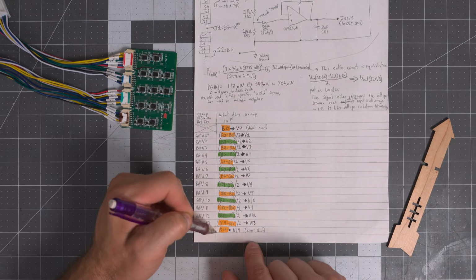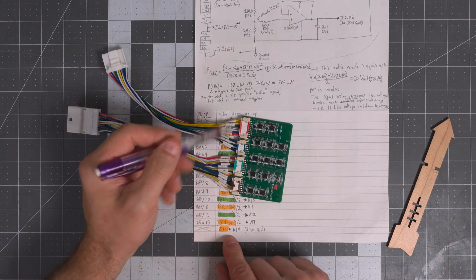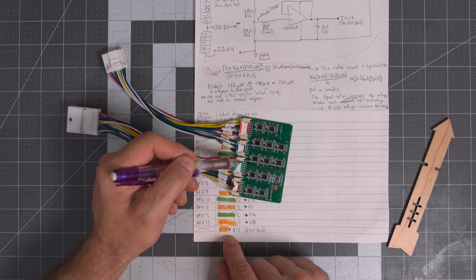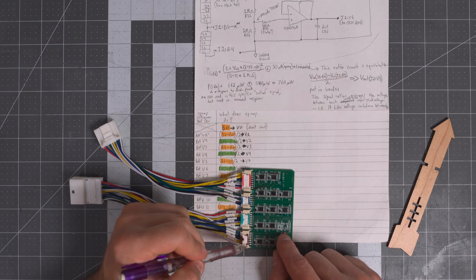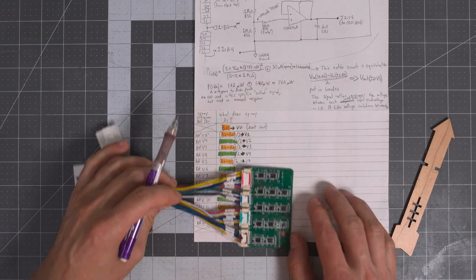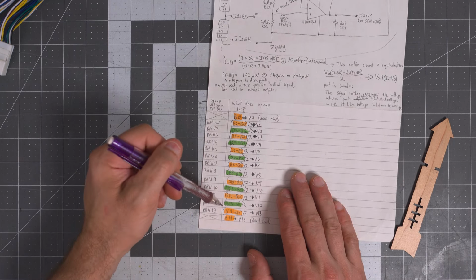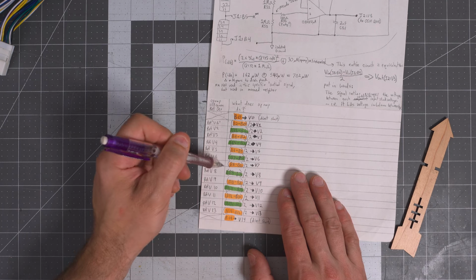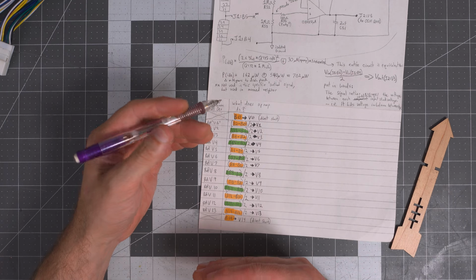We literally directly short it out here. So the input here on B14, wherever it is, I can't read this here. Here's B14, it's literally shorted to the output right there. Same thing for B0. B0 is directly shorted to V0 there. So what is this? This averages, but it doesn't average in with N-1. It actually averages in every other pairing, which is interesting. We'll look at why that is interesting electrically here in a second.